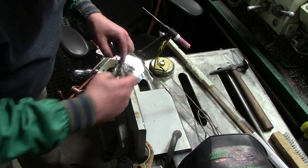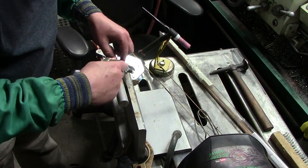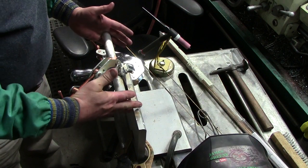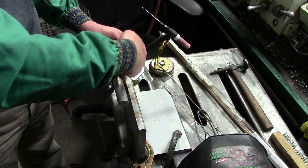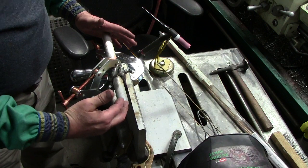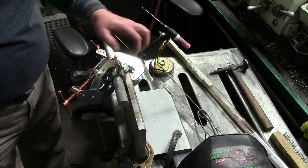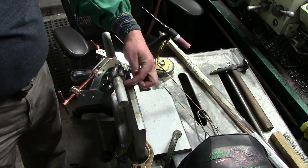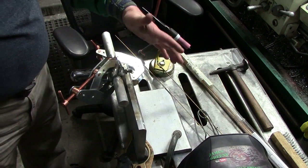So we're going to come in here, and I'm going to make tacks first, so that I don't have this aluminum causing problems. I don't know. We're going to see. When we get done, we'll take this off, and we'll even grind out underneath and fill in from the backside as well. There's a set screw, because this literally sets on a piece of his barber chair, and we've got it out. So it worked great. I drilled and tapped 1/4-20, because this is threaded through to that, worked perfect.